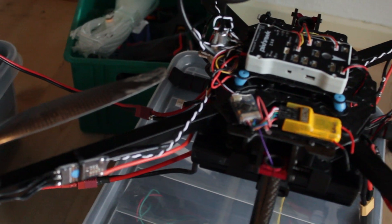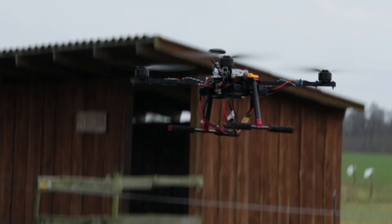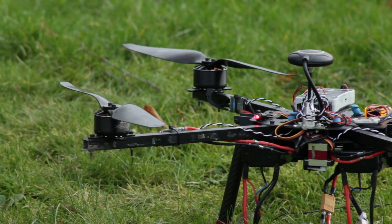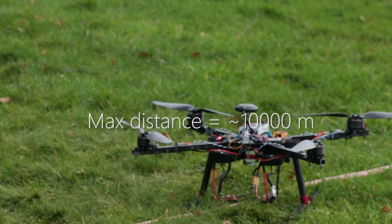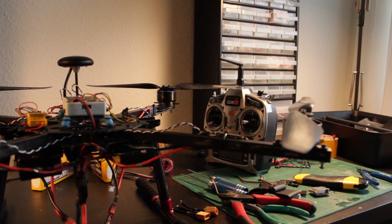For the final test I slightly changed the mission: I decreased the velocity and acceleration and topped up the batteries. The drone flew backwards and forwards between two points 300 metres apart, at 15 metres per second with a 2 metres per second squared acceleration. In the end the drone flew about 32 to 34 times back and forth — I think I miscounted a bit — which means that the drone's maximum range is about 10 kilometres. The drone can easily carry a much larger battery, so I wouldn't be surprised if it can fly about 20 kilometres.